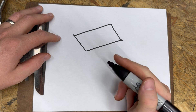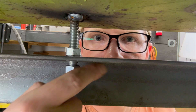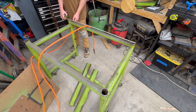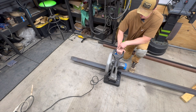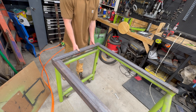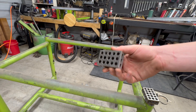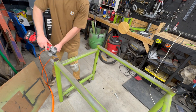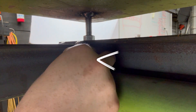Building the reaction frame. With the plate removed, it was time to build the heart of the mod - a reaction frame with adjustment all-thread studs that could fine-tune the flatness of the top. I measured the lower frame and cut some 3-inch angle iron pieces with my cold-cut saw. By the way, if you haven't used an Evolution saw, it's like cheating. I laid out the outer frame, but problem number two struck - there's nowhere for the all-thread to go with the pipe running directly under it. I think I'm going to use these 3-2-1 blocks to raise it up one inch. It also allows for adjustment just above the legs, which worked out nicely.